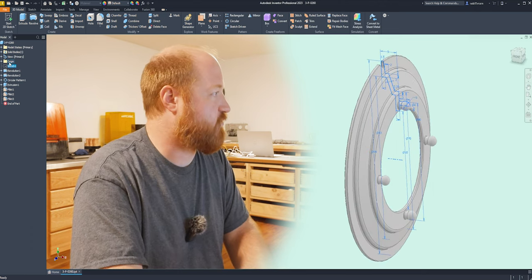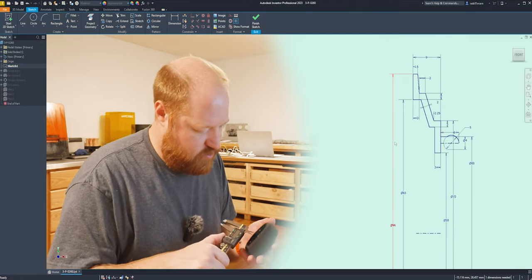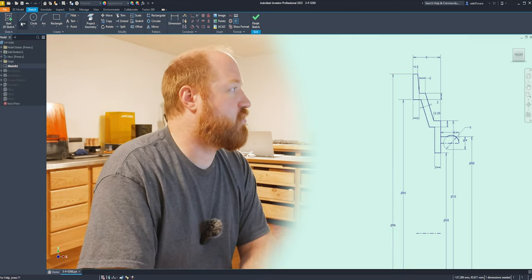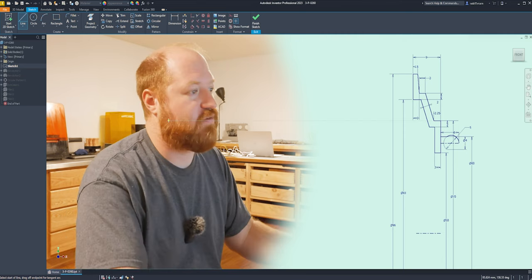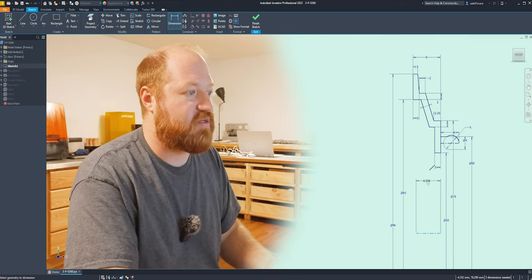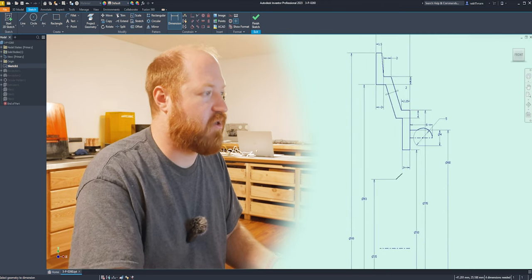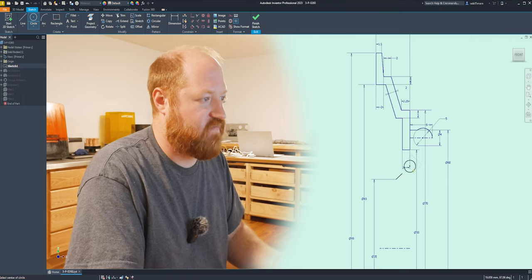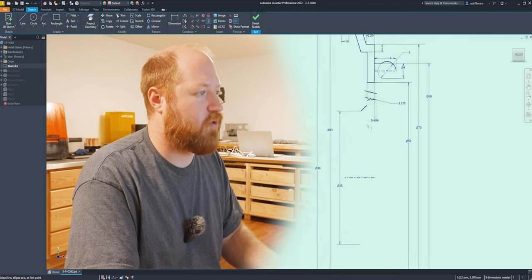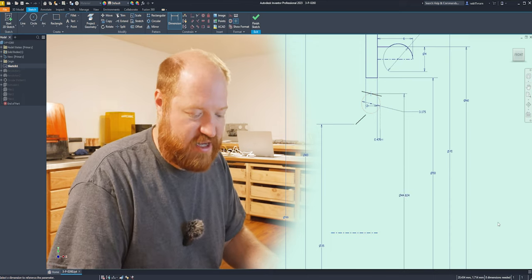To adapt for that o-ring we're going to go back into the original sketch, take some measurements, and say the new hole is 35 millimeters. It actually has a 45 degree chamfer on it, so we're going to start by just placing the 35 millimeter location and add a fillet — this is where the o-ring is going to live.